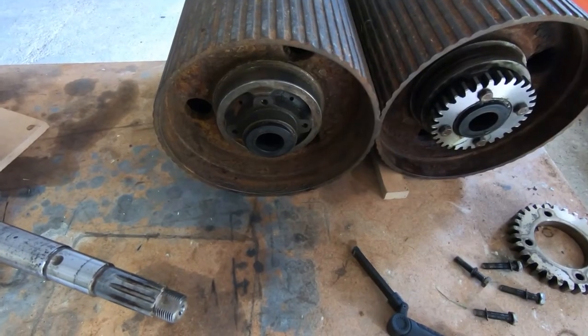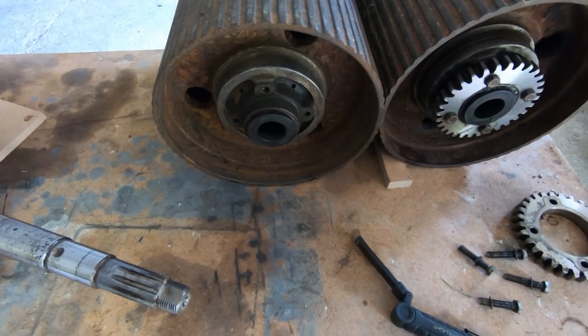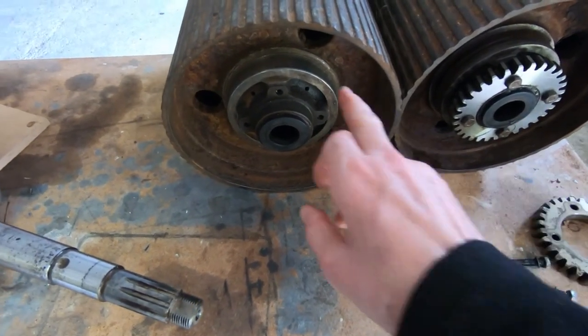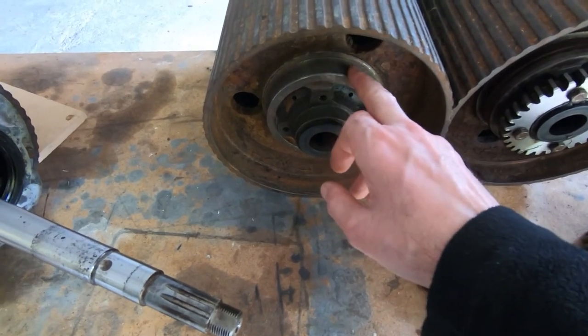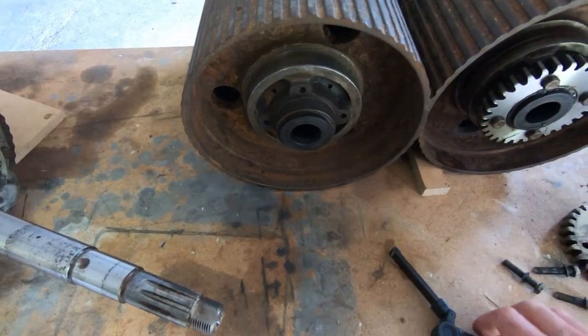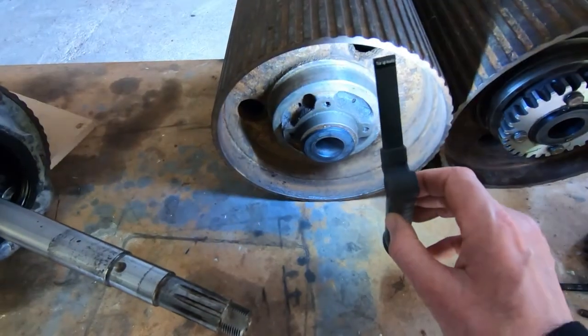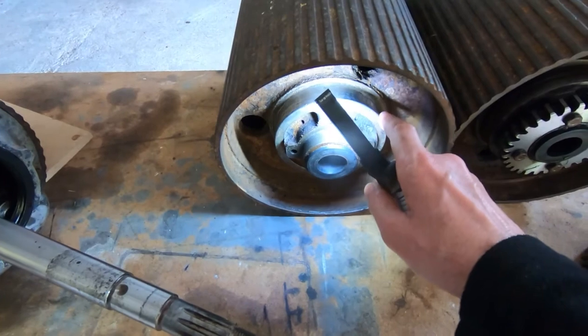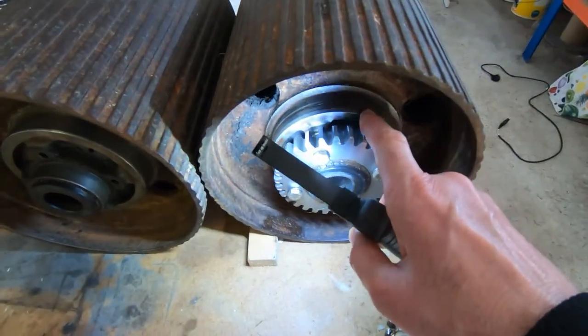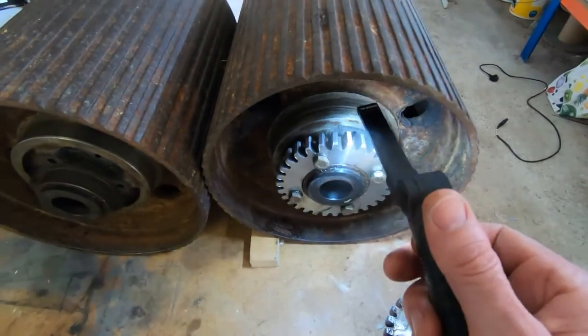It's the next day, and I've been making steady progress on this. Yesterday I got as far as machining the bearing surface, or the seal surface I should say, on the roller. Let's get a torch. And this surface here, I don't know how well you can see this, was badly chewed up, and I haven't done this one yet. This is next in line.